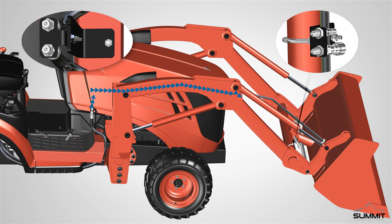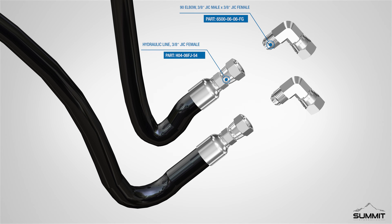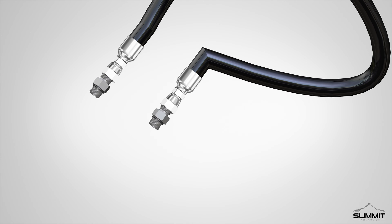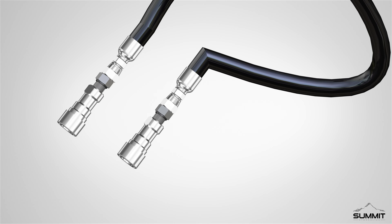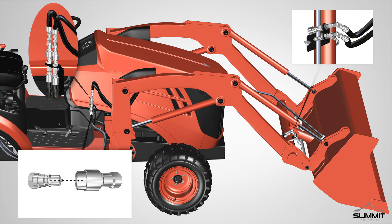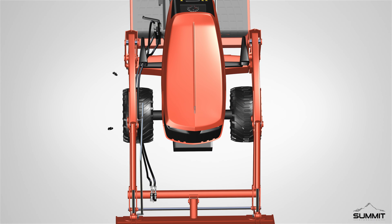Route the A and B work line hoses along the Loader Arm, and through the Loader Loop Bracket to the quick coupler mounting bracket. Locate the two hydraulic lines with three-eighths inch JIC female ends. Install two 90-degree elbows, three-eighths inch JIC male by three-eighths JIC female, onto the two three-eighths inch JIC female. On the opposite ends, install two three-eighths inch JIC male by number 6 SAE/ORB male onto the two three-eighths inch JIC female. Locate the two three-eighths inch ISOB female couplers. Install both couplers onto the two hydraulic lines, three-eighths inch JIC female. Route the hydraulic lines as needed, and connect the two three-eighths inch ISOB female couplers onto the three-eighths inch JIC male by three-eighths inch JIC female on the A and B work line hoses, to the two three-eighths inch JIC male by three-eighths inch JIC bulkheads on the quick coupler cross beam bracket. Secure the hydraulic hoses with zip ties as needed.